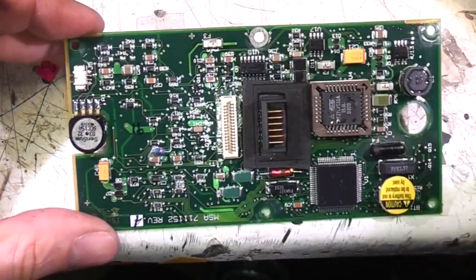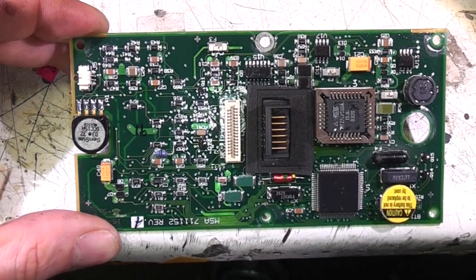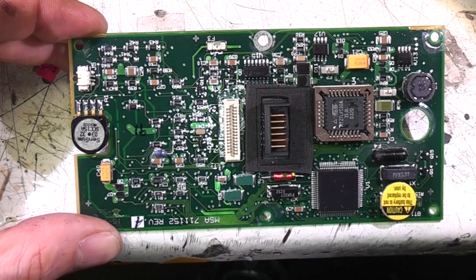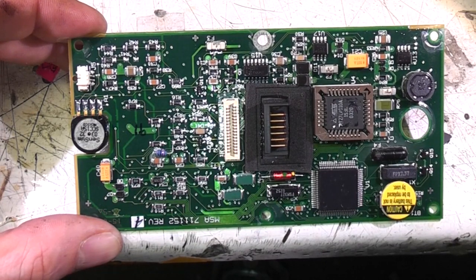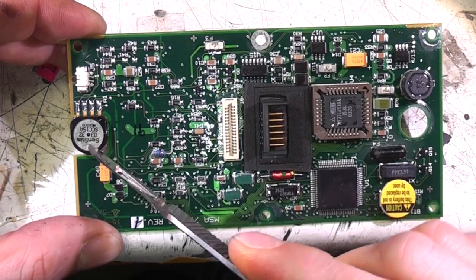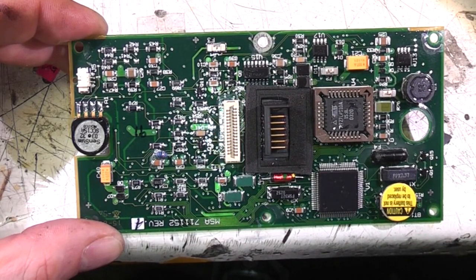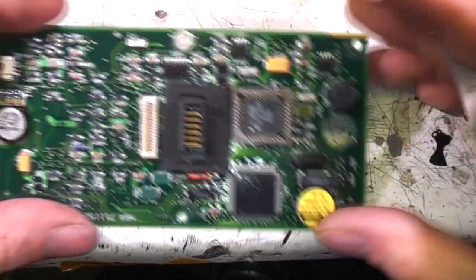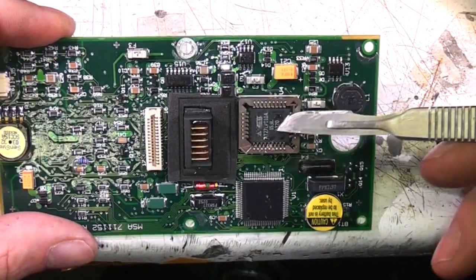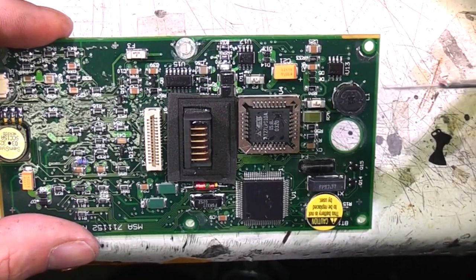A little bit on the other side — a few more interesting things. One thing here is a pressure sensor — I'm guessing there may be some calibration on the sensor depending on ambient pressure. I was a bit surprised this unit didn't seem to have any sort of air sampling pump, but there is actually an add-on that clips onto it for applications where you want to flow the gas through the sensors. I'm not sure whether this sensor is to do with detecting the pressure caused by that flow or some calibration factor dependent on ambient pressure. The main processor here is a 68L11 — I think it's a low-power version of the 68HC11 — with an external 27LV010. It dates to around the year 2000 or so.